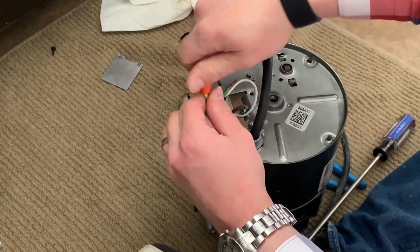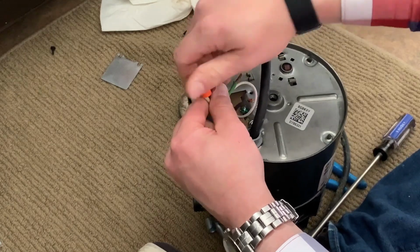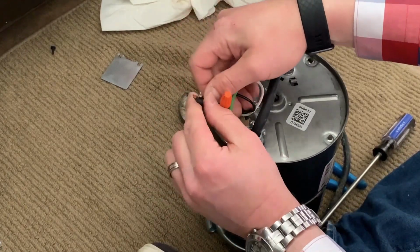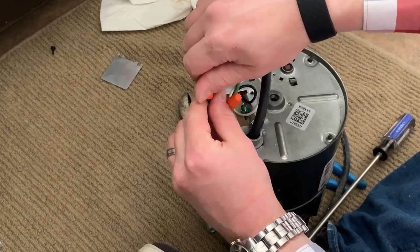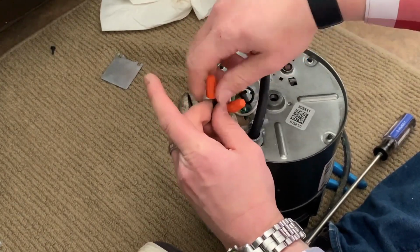The easy thing with this disposal, because I have it just connected on a plug, make sure this is nice and tight. Because it's just on a plug, I don't have to disconnect the wiring while it's still hanging there. Because if there's a wire connected to that, I wouldn't be able to pull the disposal all the way out.